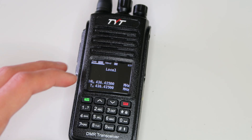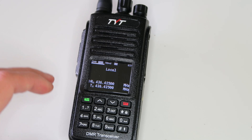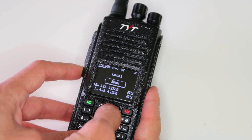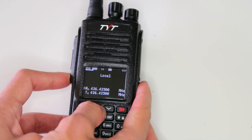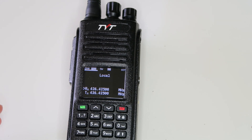Another feature I like is the power settings. A lot more fine-grained power level adjustment is possible with this firmware. On this radio I can set it to 50mW at the lowest, then 250mW, 500mW, 750mW, 1W, 2W, 3W, 4W, or 5W. This is especially useful if you're using the radio on a hotspot and don't want to be wasting your battery by transmitting at a much higher power than is necessary. There's also the ability to calculate when amateur satellites are going to be over you — I haven't used this yet, but if you're interested it's explained in depth in the manual.